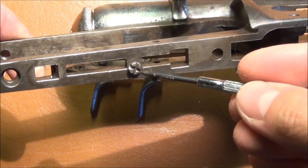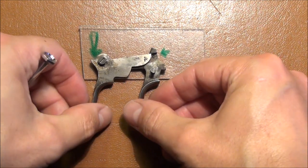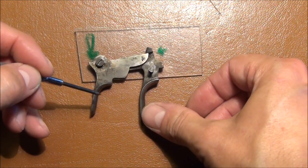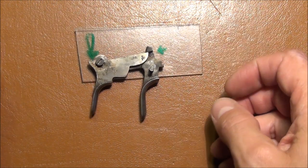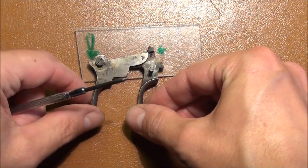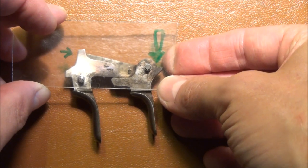What was this screw for? Quite simple: that screw pushes underneath here and allows you to set the amount of overlap at this point, which basically allows you to set the travel needed until the front trigger trips when the trigger is set. That's something you'll see on even the percussion 1851 Federal Carbine — they also have the same thing. Sometimes you'll see listings where the trigger is declared not to function, and actually it's usually just that someone has overtightened that little screw so that it can never catch. So that's a nice easy fix.